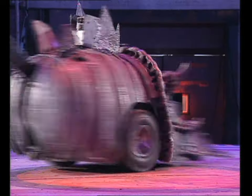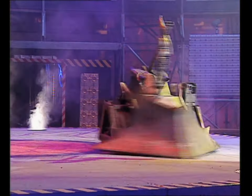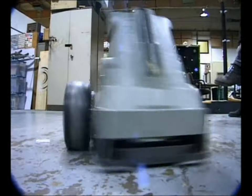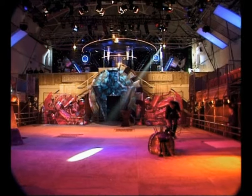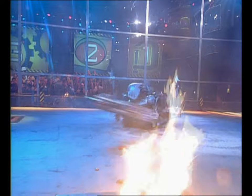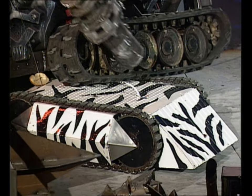Fairly early on, I set myself the criteria that these robots need to turn on the spot. They have to turn on the spot, because in this tight studio environment, if you can't turn on the spot, you can get yourself wedged in a corner and you'll never get out. So that ruled out completely things like car driving, with 2 wheels at the front driving and wheels at the back pushing you along. It ruled out most conventional forms of mobility, even the way dumper trucks work. Tanks are good, they can turn on the spot. An army tank or a digger like a caterpillar vehicle can turn on the spot.